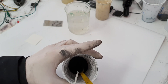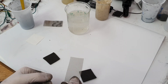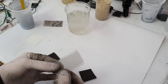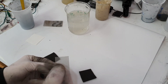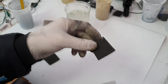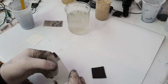Put some glue into the mix and a little bit of water and you make a slurry, then you impregnate this stainless steel. After you put this active material on stainless steel, wait a little bit for the active material to dry. When the active material is dry, press a little bit to make better contact between active material and the current collector, and your electrode is ready. Then put the electrodes into the electrolyte and wait a little bit for the electrolyte to soak into the active material.